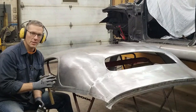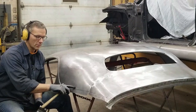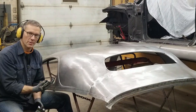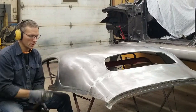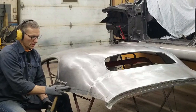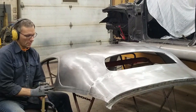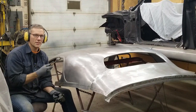When you're hearing that dull sound as I'm hammering, that means I'm just taking and bringing down that feature. I'm not doing anything with the crease just yet. The crease has to be brought out from the other way because it's going inward into the inside of the panel. So what I'm doing right now is just tapping down that profile, and I'm going to stop it about there. We have to do both sides, but we'll just do this one on camera for now.